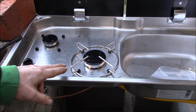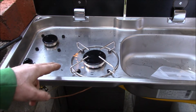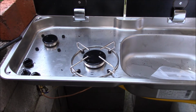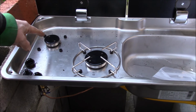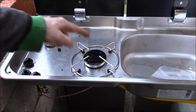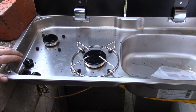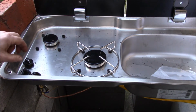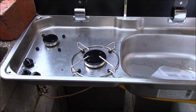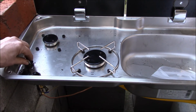Maybe I'll try 0.7 millimeter. I think I've got drill bits every 0.05 millimeters up to 1. Turn that off, and then what I did in the small burner, I put the 0.65 millimeter jet that used to be in there, and I think this works really nice here. I don't know if you can see the flames there, but it gets a lot nicer flame. There's just a touch of yellow. I think some of that's from the wind blowing out here, and again I get nice control.